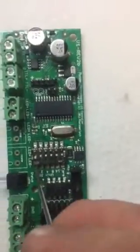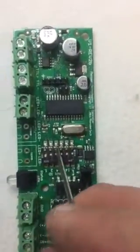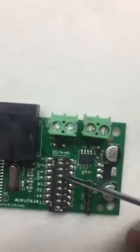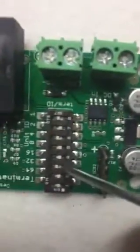So for the second box, or let's say, let's go to the fifth box. So the fifth box would be 1 and 4 on the outside, and on the inside it should be 1 and 4 on the inside. So I'm pressing 1 and 4. Those are pressed, and then plus the 32. Okay, so that's the way these boards are addressed, and that's the way they're coordinated in the software.